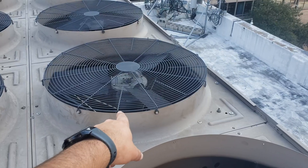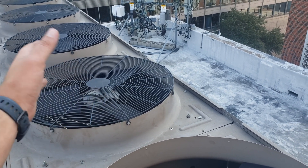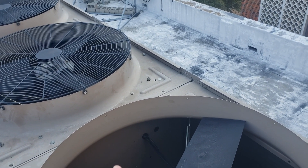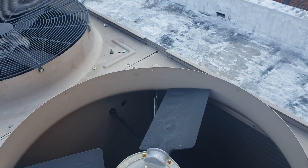So we traced it out, went to the motor, pulled the motor out and disconnected it — that's motor two right there. We pulled the motor, isolated it, and the motor checked out perfect. But then we checked the harness back to ground and sure enough, we were still getting that same 20,000 to 30,000 ohms.